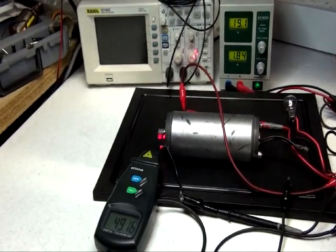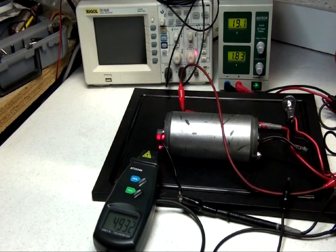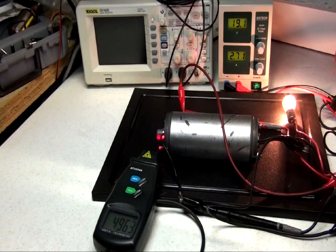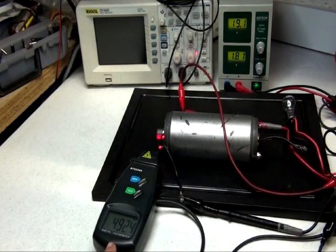So now it's 4,900. We're going to hook this bulb and watch the amperage, 1.83. It went up about 1 amp, and the speed went up, 49, 58, 60, somewhere in there, and it remains there. Now I'm going to hook the power. It dropped down automatically to 4,800. You saw it now, 49, it went up, and now it's trying to stabilize in there. 49.60. Remember, it was 49.80, 90 with the bulb on, so it went maybe 10 RPMs or something.